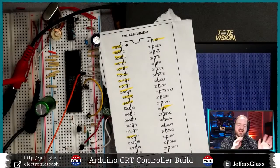That's a hand-wavy definition, but the advantage of structuring things that way is that when at least the United States made the transition from black and white TV to color TV in the 60s, 70s, 80s, 70s, it must have been. Someone can correct me on that out there. The older TV sets, the black and white TV sets, could take that luminance data and show a black and white image, and they wouldn't know even to look for this buried color signal. A newer color TV set would use that luminance component, the brightness component of the image, to create an image and then layer in the color component on top of that to create a color image. So you didn't have to have everyone throw out their black and white TVs when we switched to color television, at least here in the United States. From Belgium, I believe the system is different.